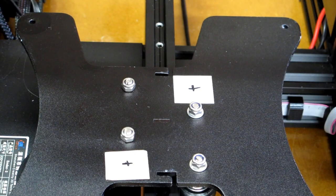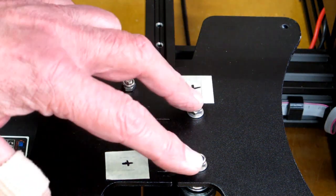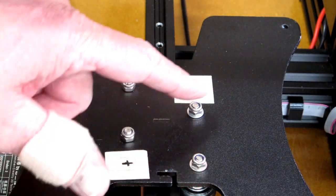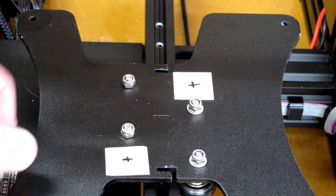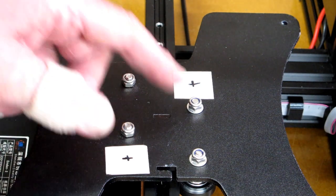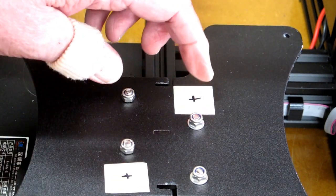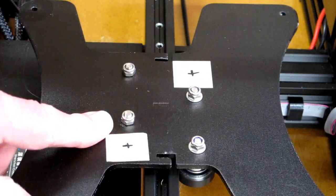For those of you who have a table with staggered wheels on the Ender 3, the problem is that two wheels are stationary and two have the eccentric adjustments. You can back one off and get three wheels to ride pretty smoothly back and forth, but as soon as you try to bring the fourth one in to where it carries some of the load, it throws out the other adjustment. The CR-10 has the wheels directly opposite each other, and that's what I intend to do with this.